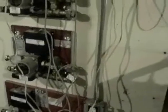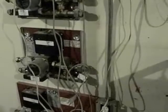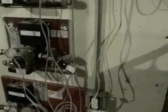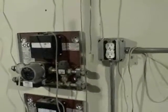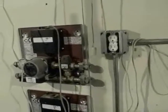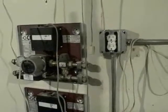Pump one controls the full basement, and I have got a manifold valve that is here. Pump two will control the perimeter heat of the house, which is not installed. You put a perimeter line, probably two loops around the whole first floor. Then pump three would control the bathroom, the master bathroom and the master bedroom. The thermostats are in place in the walls already.